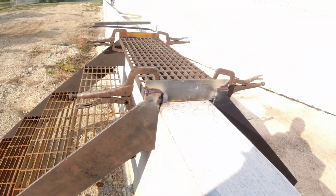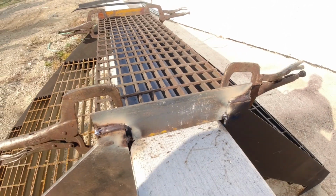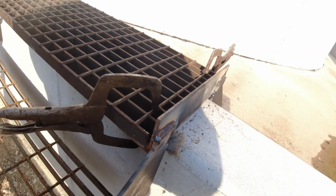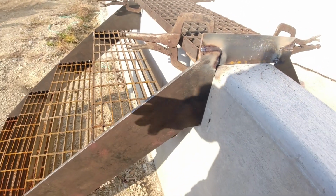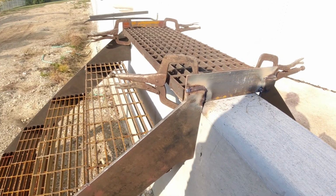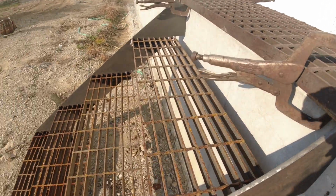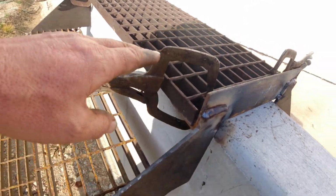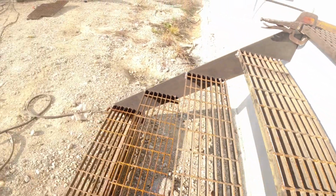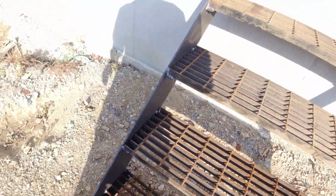The way it's connected, it's a piece of 3-inch, 1/4-inch angle, and it's welded on there. So the bigger you are, the heavier, the 2 stairs pinch the wall. You can see the top step, that's 12-inch. These are all 10, just to have the hangover on the wall, and I'll have the 8 inches from here down, 8, 8, and 8. And this step here right now is to the ground about 9. But like I said, still got to get concrete put in.